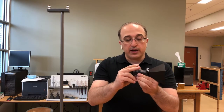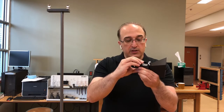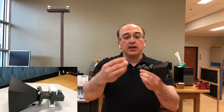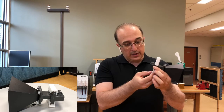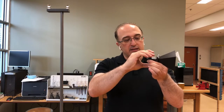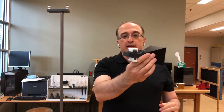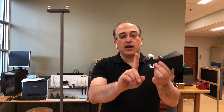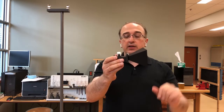To make a firm connection, I'm going to align the holes of this waveguide with the other waveguide. The Lab Volt training system comes with something called quick-lock pins — the pin goes through the holes and we use that to make a firm connection. I'll place one here and one on the opposite side, then bend them so they are very tight, giving us one unified system that you excite from the SMA port, producing vertically polarized radiation.